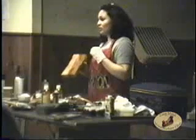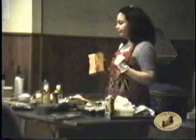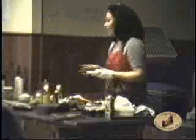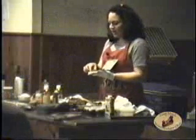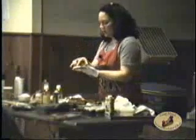Shellac in 15 minutes, you get a ring on. Shellac is very fragile, so you really want to protect your shellac. And here you go. So now, if you have a dent in your shellac, the repair is burn-in sticks. If you've seen these, this is just shellac, and we can pass this around to see it. This is the hardest repair to make.